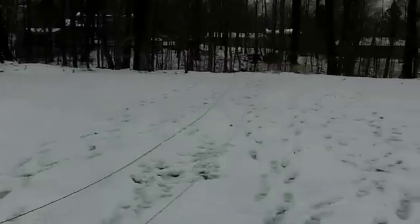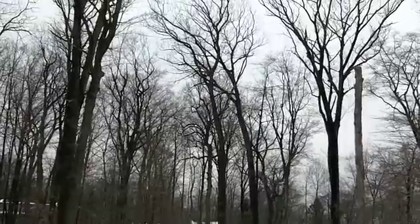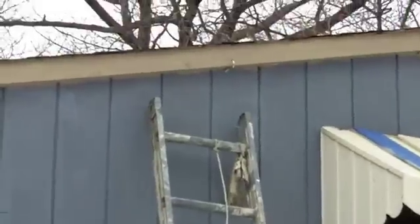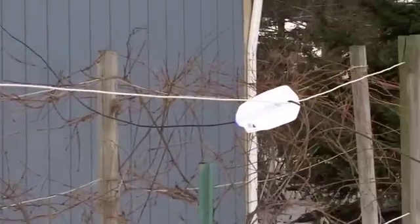What we're currently doing is taking the antenna wire and putting it up to about that particular tree over there. What he's doing now is tying off the insulator. The idea is we're going to take it up to that particular point on the barn where the little eye hook is, and we'll put a spring — and you can see the coax running down.